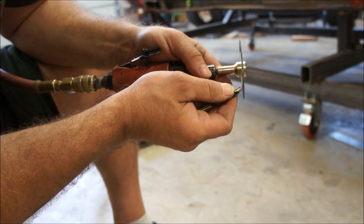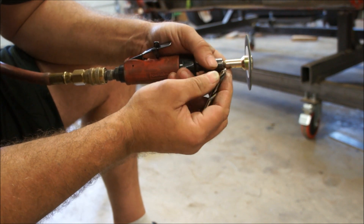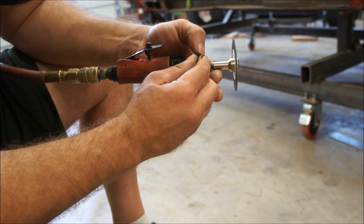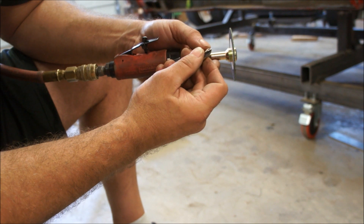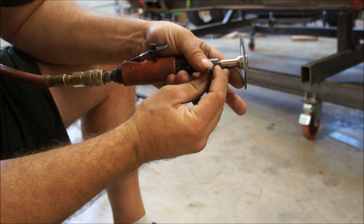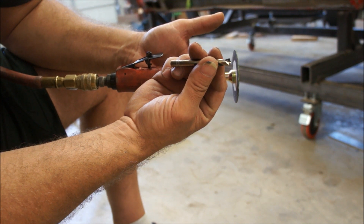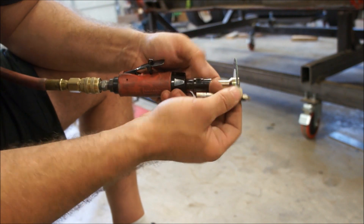That tip has an angle, but my eyes aren't that great and I wear glasses anyway. If I was to try to resharpen that, I might get away with it, but you'd almost have to have a little magnifier — one of those magnifying glass deals you can hold in front of it. But ultimately, that's just a pilot, so it's not taking the brunt like what this main edge is. This is resharpened and should be spitting off some pretty good chips. You can see it's shiny on the edges where I ground it. What do you got to lose? You're going to throw it in the trash, so why not give it a shot? If you fix it, you've got another 20 spot welds.